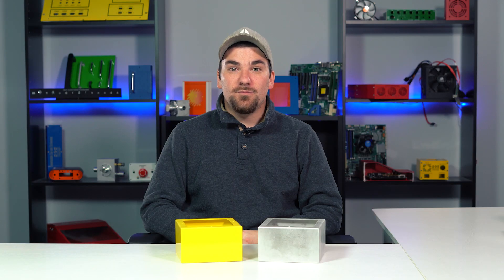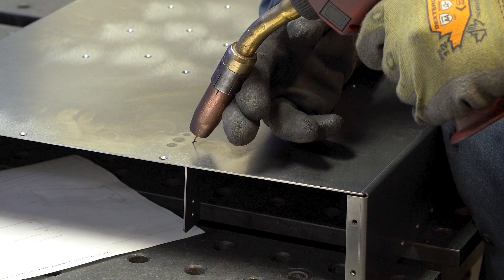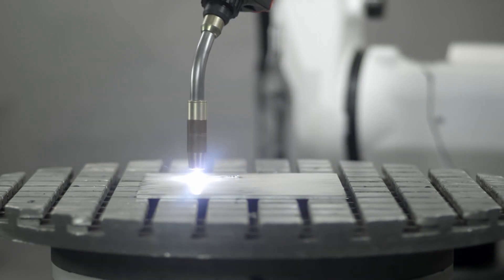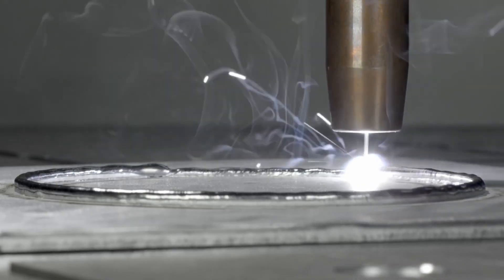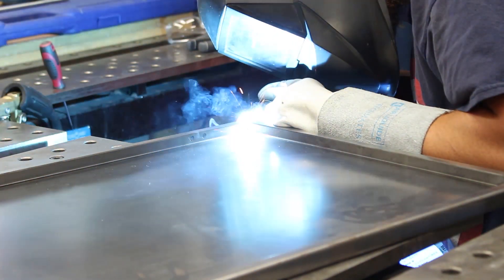The CMT process physically resembles MIG welding, however the main difference is the wire feed. Rather than continuously moving forward in the weld pool, with CMT the wire is retracted the instant current flows. The weld wire and shielding gas are fed through a welding torch, and electricity arcs between the weld wire and the welding surface, causing the tip of the wire to liquefy and be applied to the welding surface. CMT uses automatic activation and deactivation of the heating arc to systematically heat and cool the weld wire, bringing it into and out of contact with the weld pool many times per second. Because it uses a pulsing action instead of a continuous stream of power, CMT welding generates only one tenth of the heat that MIG welding does. This reduction in heat is CMT's greatest benefit and why it's called cold metal transfer.